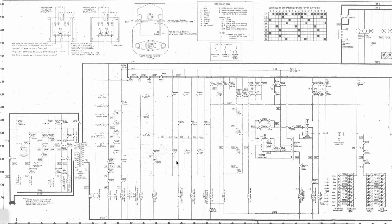So going back to the schematic, the problem centers around the ball release solenoid. And so it's these two rungs here, plus this lot. I think the key thing is, there's a game over relay, so it does momentarily go off, so that makes contact. The reset relay, on the other hand, is a key part of this, because it powers the ball release solenoid directly. And the reset trip is here, so we'll bring that over as well.